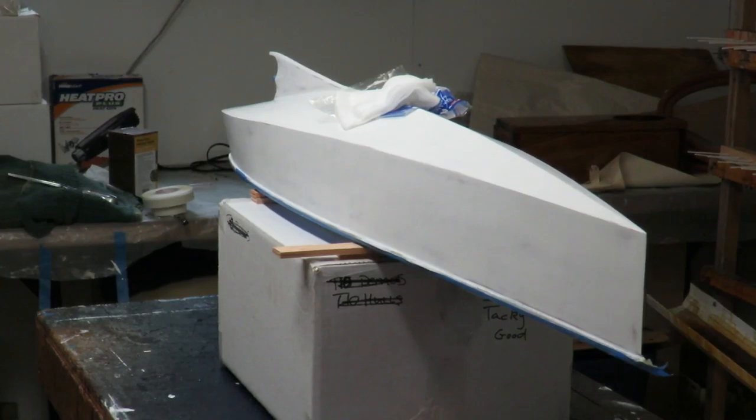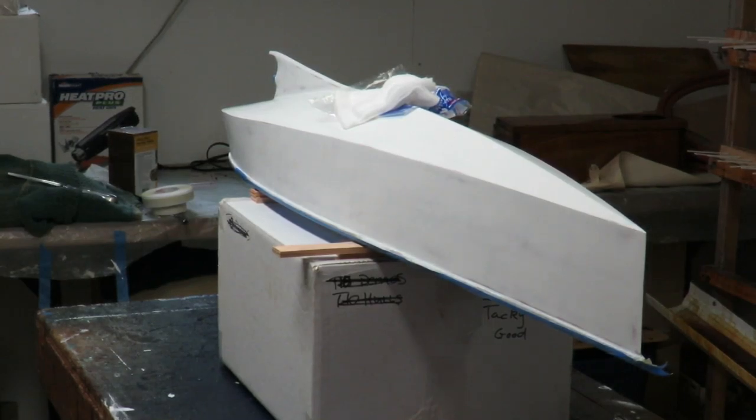When you see a perfect paint job, and you say, oh, what a good paint job, what you're actually seeing is what a good sanding job that was. Because you cannot do a good paint job unless you get the sanding essentially perfect. The paint job will not be any better than the sanding is. In fact, usually it's much worse if you haven't done adequate sanding, because you tend to want to cover up. You can see that a brush mark or something's going to show through, so you spray it a little bit heavier, hoping that it'll cover it, and then you get a run or a sag, and that's a real mess.